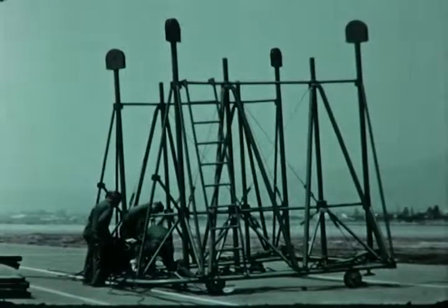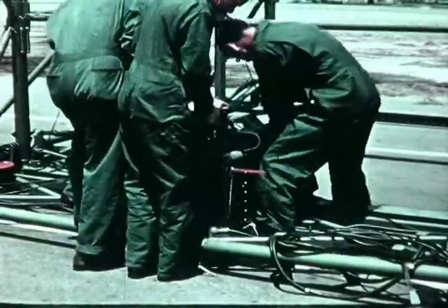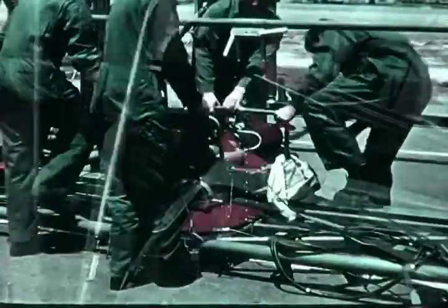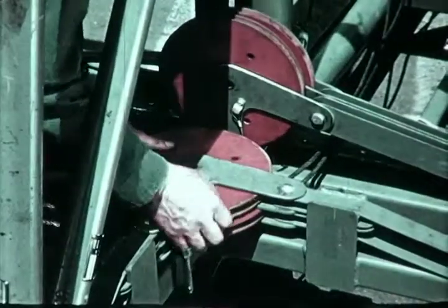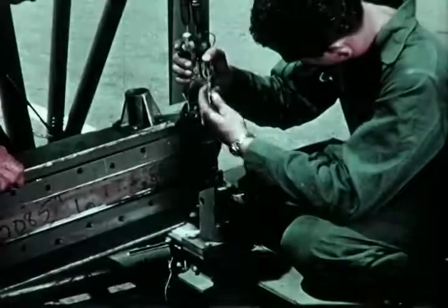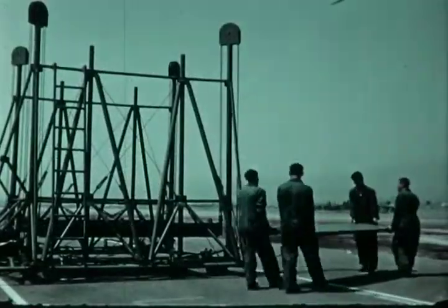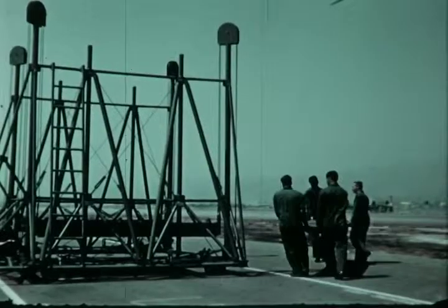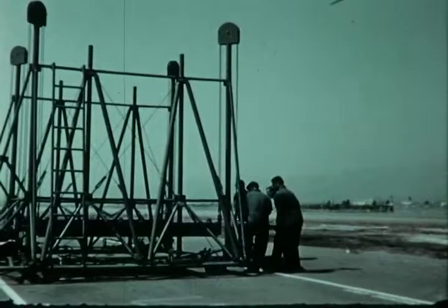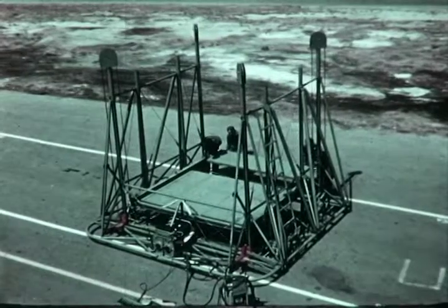The motor winch has two synchronized and grooved drums which level wind the galvanized steel cable. Dual cables are routed over micarta pulleys and fastened to the platform side girders. Four sections make up the elevator floor to provide 100 square feet of platform. The last section is secured with self-locking pins.